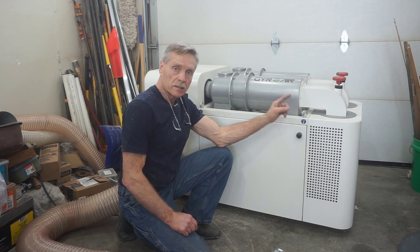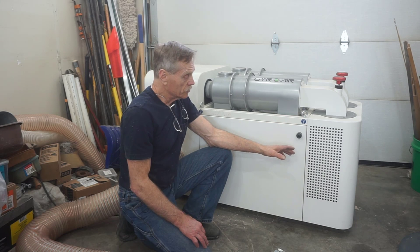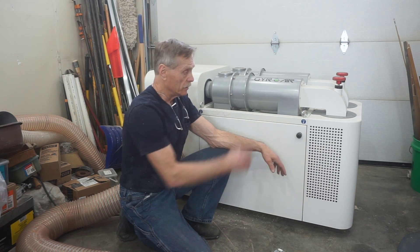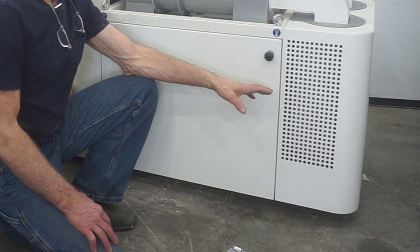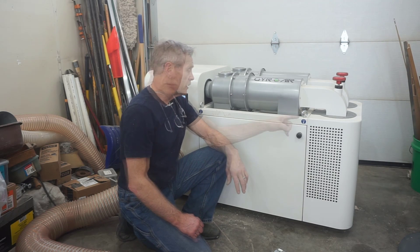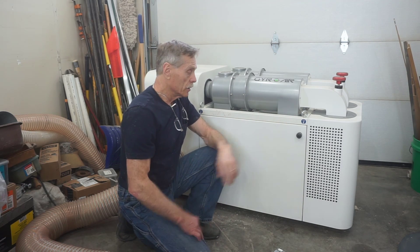Keep in mind that's the finest dust, so it's really pushing the capability of the machine to get that dust to spin out of the airflow before it gets to the filter. I did a short cleanup on those two ports some time back after cutting up a whole stack of particle board, thinking with this fine dust it's going to plug those filters. At the time, there was barely a handful of flour in the bottom, so I just misinterpreted that and let this go longer than I should have between filter cleanings — older and wiser. But after just a few minutes going back and forth from one port to the other, those filters are wonderfully clean and good for a whole bunch more work.